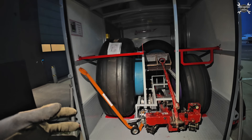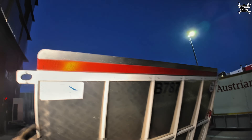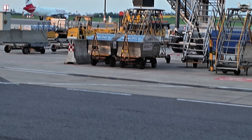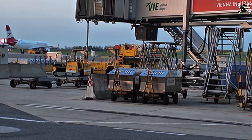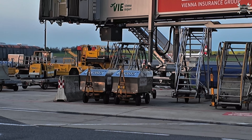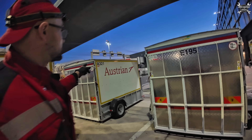As you can see we are completely ready to replace a wheel on the line. Each trailer has similar equipment, adjusted to the needs of that exact airplane. Other than that, for wheel inflation we have those two carts over there — that's only for nitrogen. You can find a pistol gauge and everything you need to inflate the tires. Now we're going to hook up the A321 trailer and go replace a wheel with it.